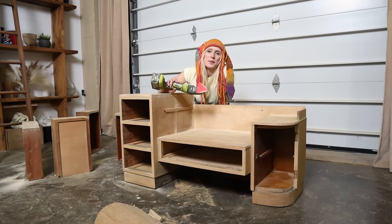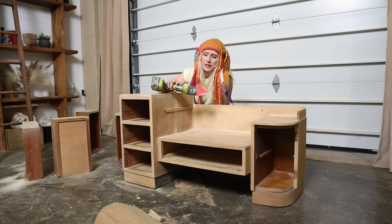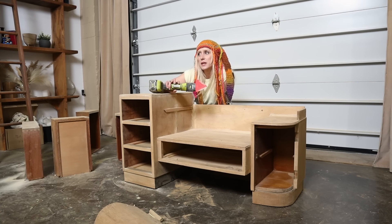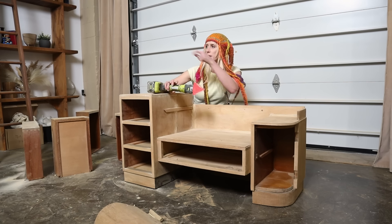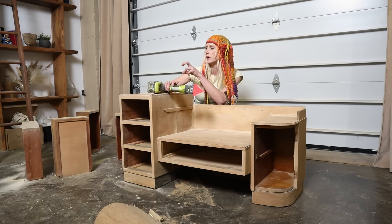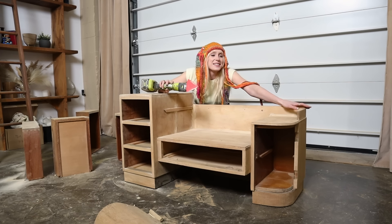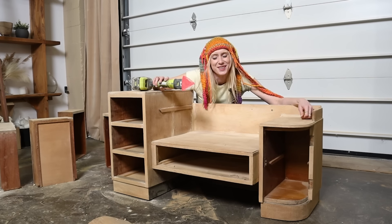I know my wood filler is too light and I knew that to begin with. I just didn't feel confident in making my own because sometimes the glue doesn't want to take to the stain. So when I saw that we had a stainable wood filler, I thought that would be the right choice. But now I'm thinking for any areas that are really obvious, I'm going to mix that wood filler we already used with some of the sawdust, and I think that will fix this problem. And honestly, every time I do stuff like this it's always a learning experience — I hope you enjoy coming on the journey with me.